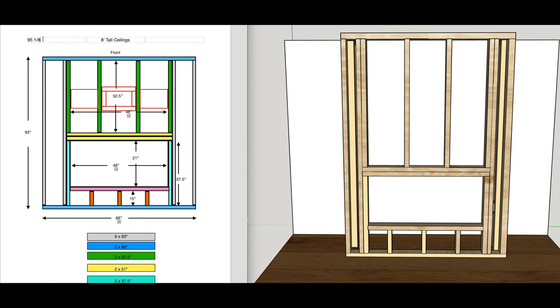So if your raw measurements come out to 95 and 1/8, subtract 1/8 inch and you get 95 inches as your working number. In my measurements I used 96, which means these gray studs are 93 inches — because if your total length is 96 and your bottom plate and top plate are each 1.5 inches, then 96 minus 1.5 minus 1.5 equals 93. The only other set of studs that would change depending on your ceiling height are the green ones, which we'll get to shortly.